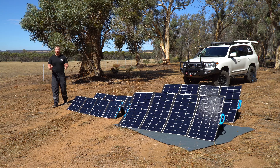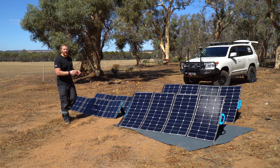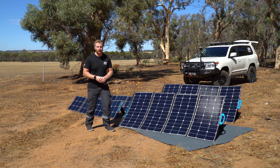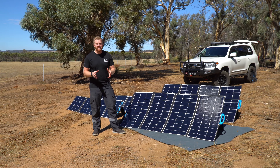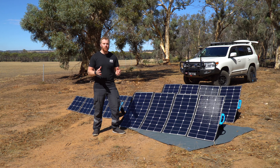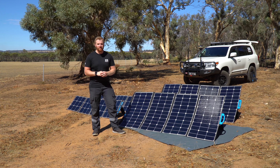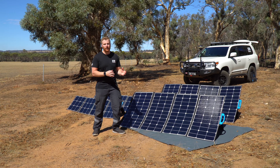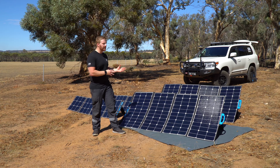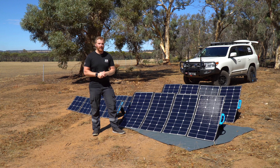Today's testing shows that BlueWeddy have managed to retain the quality and efficiency noted in the SP200W panels and brought that over into the larger SP350W panels. Testing also showed that connecting these panels in series over parallel makes a huge difference to efficiency and power output — we saw that power output increase from 464W to 575W, which would effectively knock off about an hour and a half of charging time when charging the AC200P from 0 to 100%.